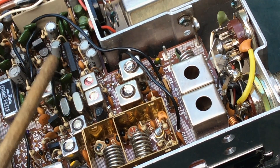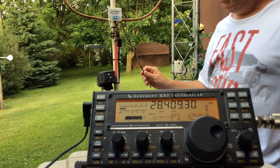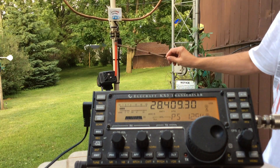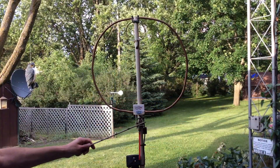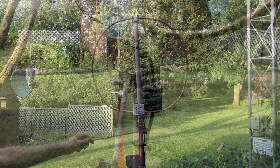When you're tapping around it sounds like you're tapping on a microphone. This can be kind of hard to figure out the source sometimes. But here's a new one for me — it seems like my antenna is microphonic. I'm using a high-Q tuned circuit loop antenna, and tapping mainly on the tuning capacitor is where it seems to be coming from.